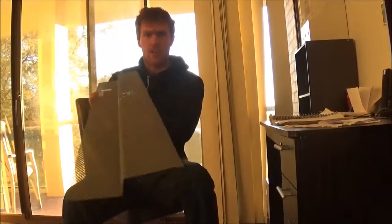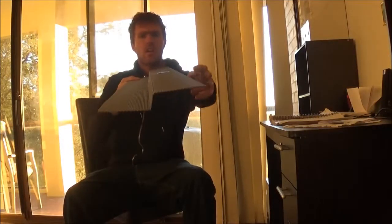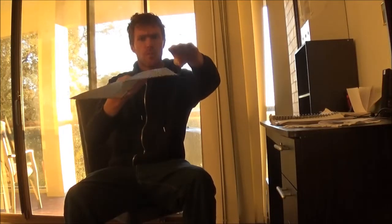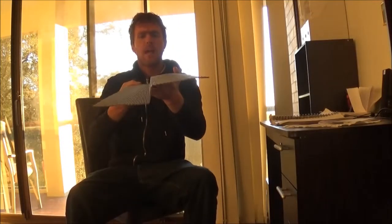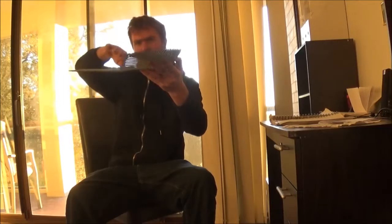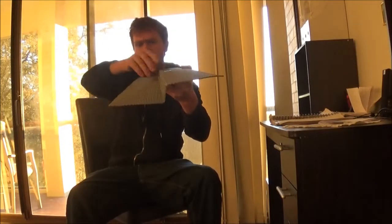Let's take a look at this guard. We can see the groove. The way it gets installed is this edge is screwed into the edge of the gutter — just on top of the lip of the gutter — and then this part dips into the gutter and sits just below the gutter and a little bit above, near to the roof. What I don't like about these is that when it's installed, there's a slight angle back towards the roof. So when rubbish lands on top, it gets pushed across back towards the roof side and lands into this gully.